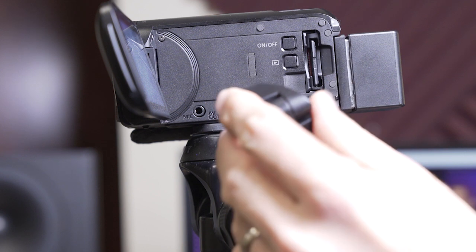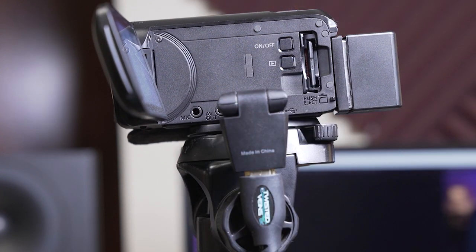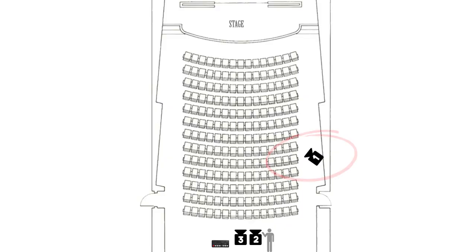Now let's talk about how to wire up these cameras. The ATEM Mini only has HDMI inputs, and my general rule of thumb is never run HDMI cables longer than 15 feet. So if your Mini is located in your tech booth and you're using something like my camera arrangement, camera 2 and 3 could be located right in the booth with you — just run HDMI cables from those nearby cameras to the Mini. But for my static camera number 1, it's across the room, so I need to run a longer cable. HDMI was designed to connect your DVD player to your TV — it wasn't really ever meant to send HD video signals over long distances. So while you may find longer HDMI cables and all sorts of gimmicks for extending HDMI, the vast majority of those are just that — a gimmick, and you're going to pull your hair out dealing with them.